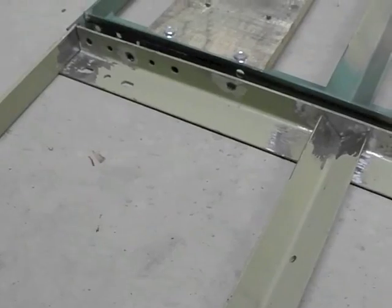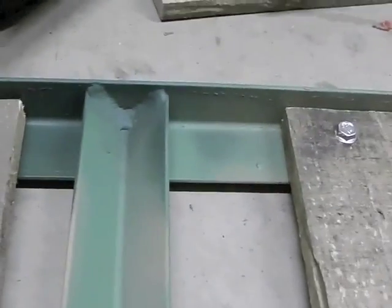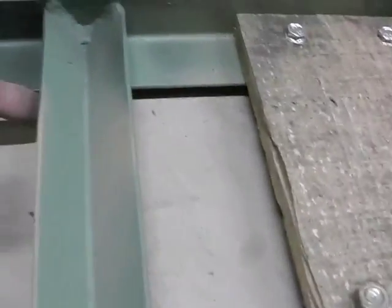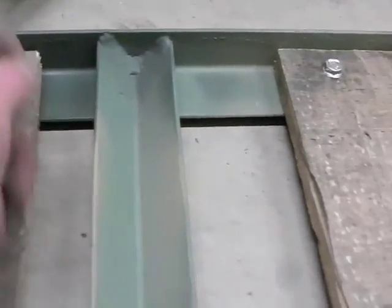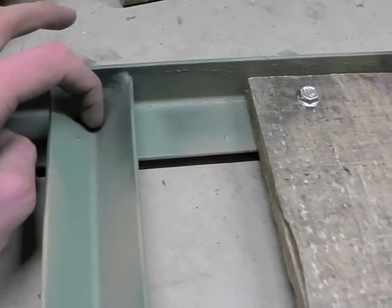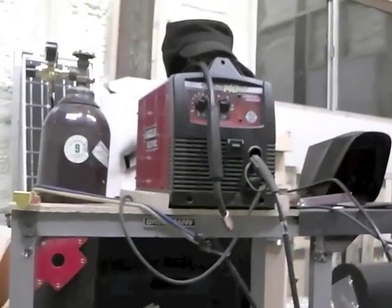Anyway, we'll get those done up real quick. For these, the way I welded them in on this one — don't look at that weld, look at that weld — I V'd them like that, and then I gave them a little tack weld underneath, but I wasn't sure that was going to be enough. So I drilled a hole in the bottom plate and plug-welded it through. That has to be a fairly large hole, or the welder will just fill the hole for you.